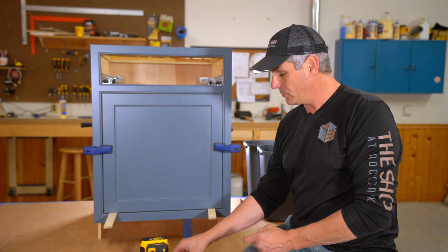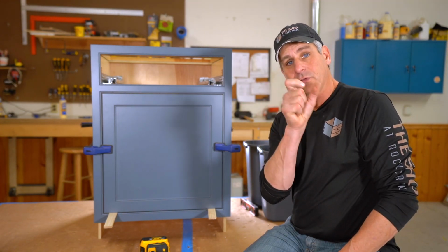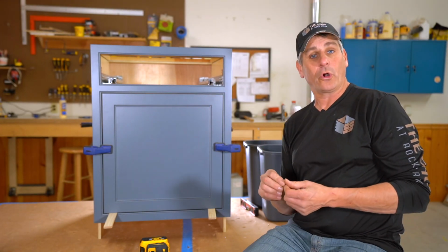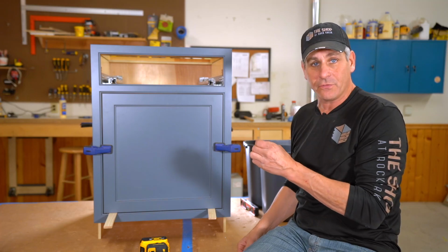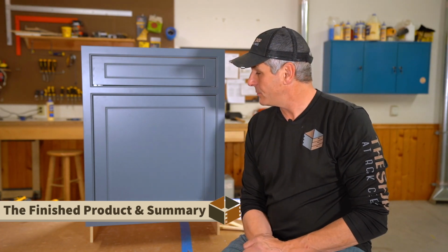So I'm going to go in with my screws. I want to use a screw that's no deeper than, with a 5/8 thick drawer box and 3/4 thick framing, something less than 1.5 inches, an inch and a quarter would be ideal, to run in there. You don't want whatever screw you use to poke through the front of this, so make sure you don't countersink it too far and drive it through. Be very, very careful. Okay, that completes the installation of the tandem trash pullout.